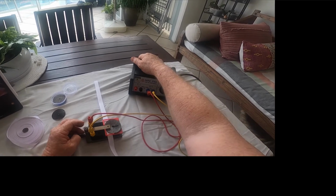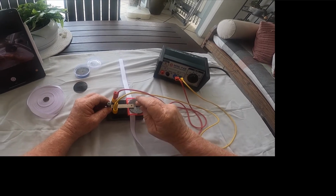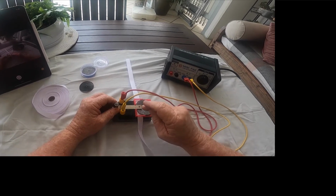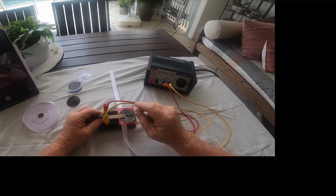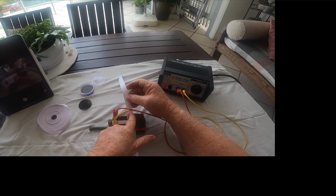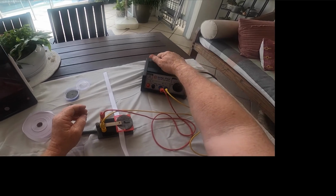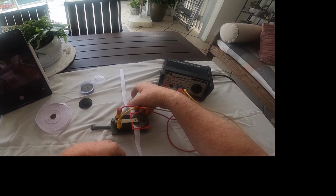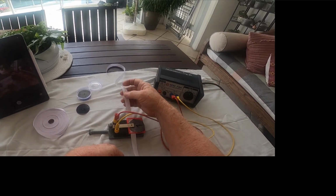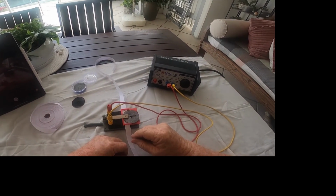Now that is not a bad setting that it's on. It's got to bounce sufficiently to make an imprint on the bottom, but not be so tight that it won't hammer all the way down, and not be so loose that it just flaps around. Let's just have a look and see if we've actually got any dots on there. Well, they're all in the one spot right there, but that's because we haven't actually moved the tape. So now let's try it again, leaving it on 6 volts because we know that works. Move the tape along a bit, and you'll see the paper trail is left. Now that is a perfectly working ticker timer, and it should be no problems whatsoever.